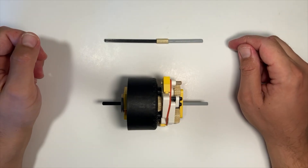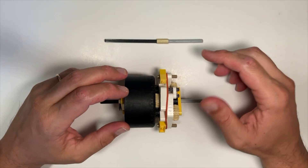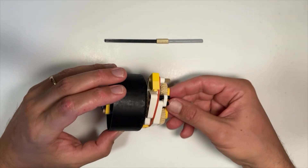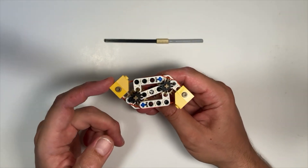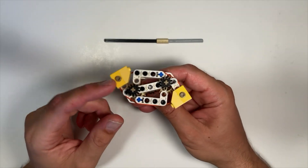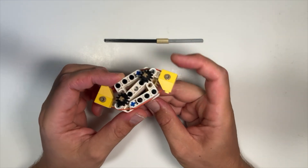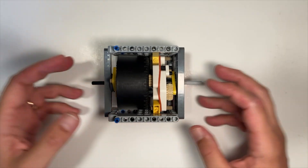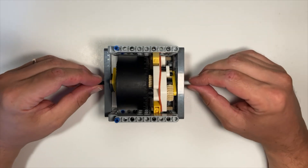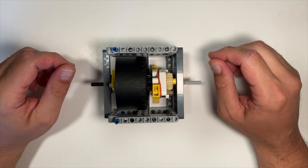Consequently, this gives us a maximum gear ratio of one to one. Now, while this transition is happening, we have to remember about these ratchets. The really efficient thing about them is that they are calibrated to be in effect while the spindle is completely stopped or slowly moving. However, once the spindle begins to be driven by the drum, the heavy ends of the ratchet mechanism cause the functional ends to retract due to the centrifugal effect. So the important point is that while the ratchet mechanisms create some noise and resistance during the transition phase, these negative factors are completely eliminated at higher operating speeds.